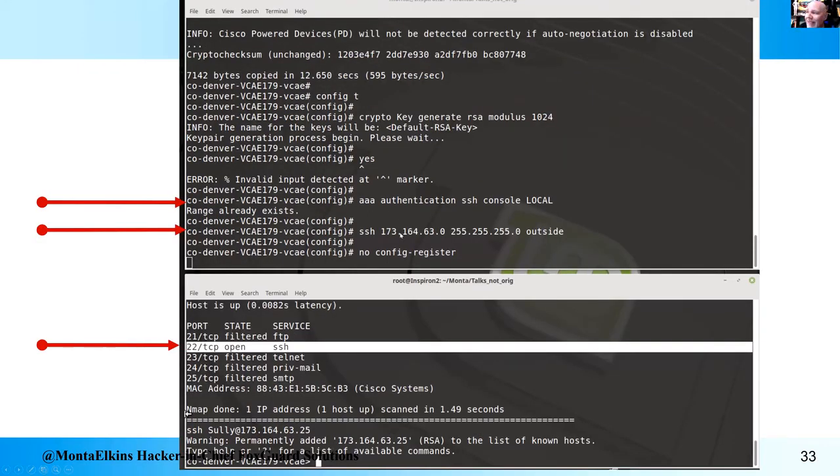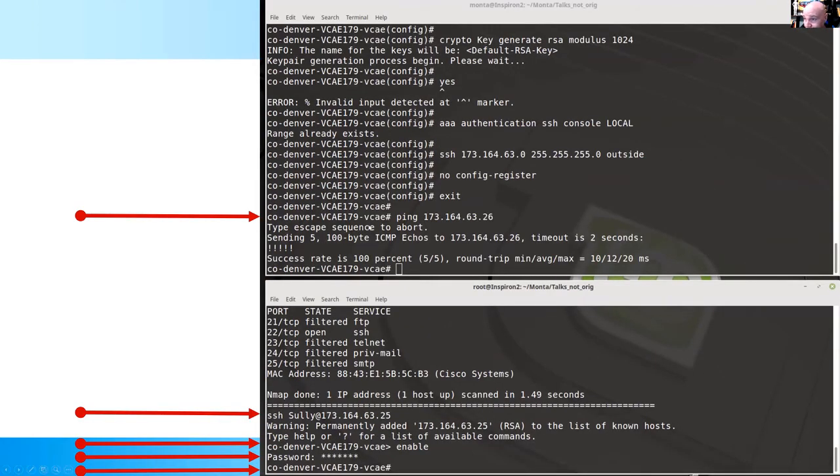Here's what it looks like in sigrok — up here is the serial port traffic, and down here is a window connected to the Cisco firewall via ethernet for testing. As the machine boots up, I have a few seconds to press break or escape to get into ROMMON mode, then change it to say no password needed, boot without a password, copy the running config, add SSH to the device — if you're going to own this machine remotely, do it securely — and it pings my IP address when done. I can then SSH to this device with the username and password I set up and go to enable: full remote access across the internet.